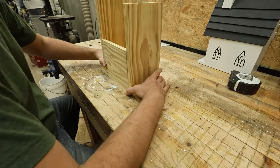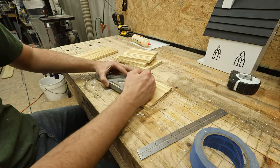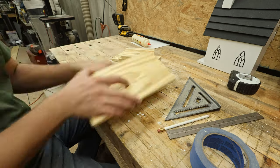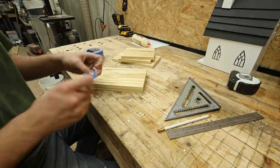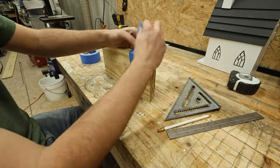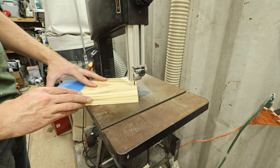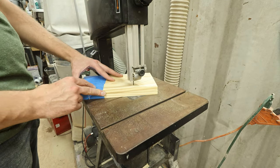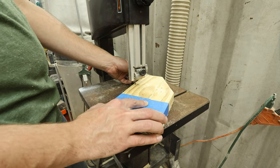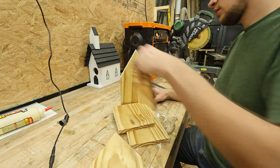The two ends are going to have a sharp angle cut to them. What I did is set it up on the base to see how it's going to be assembled, then marked where the top of the walls are and went from there to the center at the very top of the piece. To get the two ends exactly the same, I'm taping them together with painters tape and then taking them to the bandsaw to cut along those lines. This could easily be done at the table saw, with a circular saw, or a jigsaw. Now we take it out of the tape and go about assembling our birdhouse.